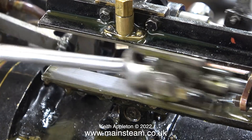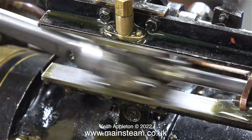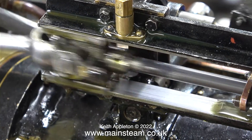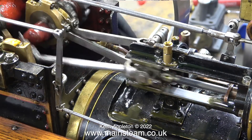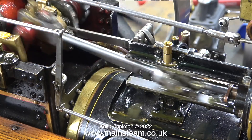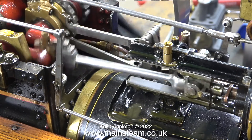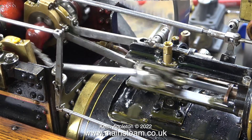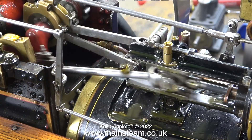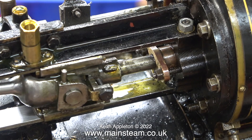After the flywheel, crosshead, and gland work, the engine doesn't seem to be rattling at all. But the whistle is painful — I may try to lower its frequency because it's very high pitched. One of the drain cocks is broken. Out of curiosity I checked a video shot by Simon Hudson driving this engine, and the drain cock wasn't broken then. The very small 10BA thread at the top of the drain cock has snapped off. I have repaired that, but didn't bother videoing it as it was a really fiddly job.